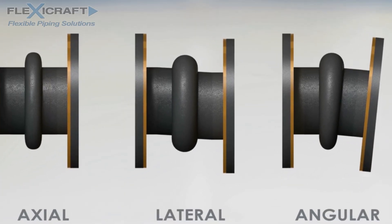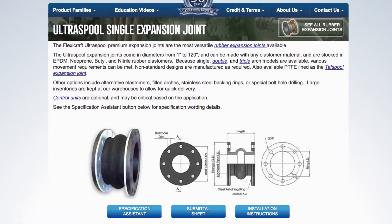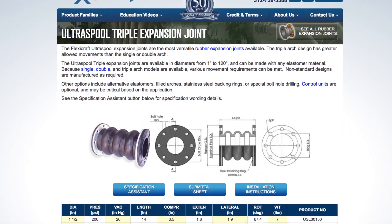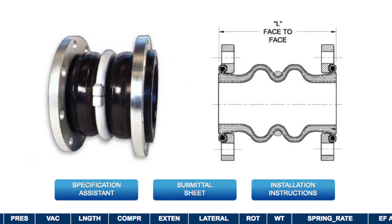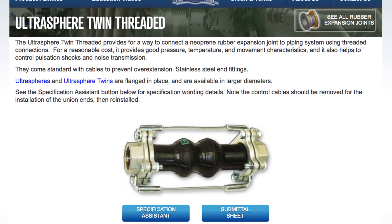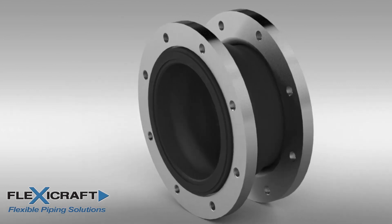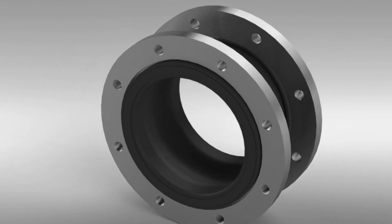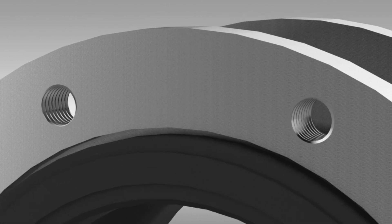The movements are largely a function of a rounded arch or arches in the joint. There are two main rubber joint styles, commonly referred to as spools and spheres, each with different design elements, including the types of arches used. Spheres, such as the FlexiCraft Ultraspheres, are economical and are most popular as flexible pump connectors. They have an extended, ball-shaped arch, and lips that extend through thick metal flanges that seal against the mating flanges. The metal flange holes are often tapped for ease of installation, so a backing nut isn't needed. The joining bolts simply screw into the flanges.